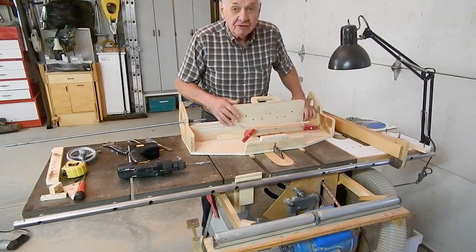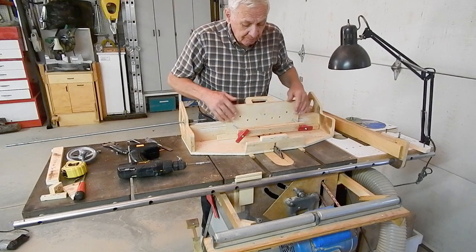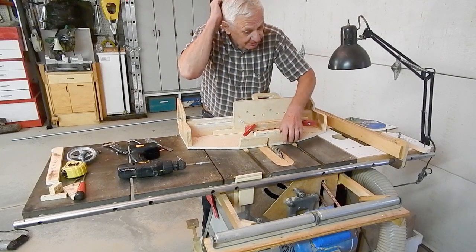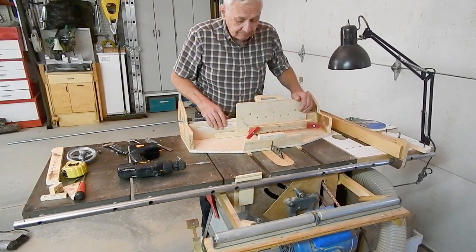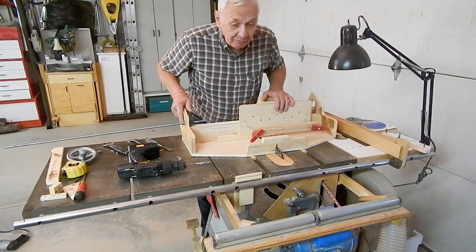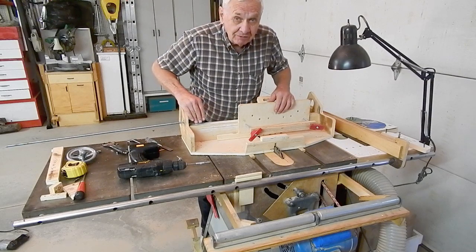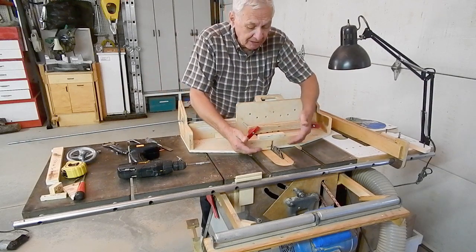There is a learning curve to have good success making box joints, and I'd strongly recommend trying a project with scrap wood first. It's tricky to get the dado blade thickness precisely correct — it might take some thin paper shims to get the thickness of the tongues and notches right. But once you master it, it's a tool that can make very neat-looking box joints in quarter-inch, three-eighths inch, half-inch, or three-quarter inch — any factor of the 16 threads per inch threaded rod and any factor of the thickness of dado blades you can make up.